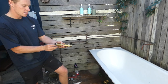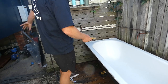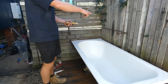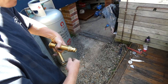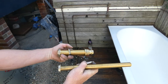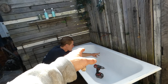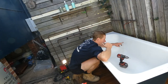This will be the suction line — that's what you'll see on the inside. The water will suck out, go through the pump, through the chiller, push back around, and there'll be a half-inch feed that'll push back into the water — so it's just constantly cycling. The suction fitting has a rubber ring on either side which will seal it over the cast iron bath. It sucks from the top so the warmer water at the top gets drawn down to the pump and down to the cooler.